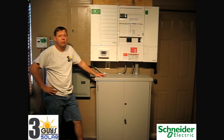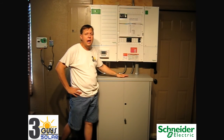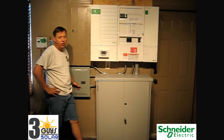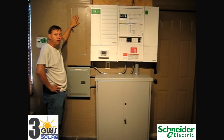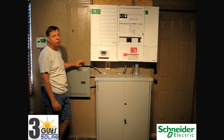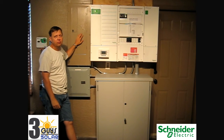As I said previously, this system is grid-tied, so we're going to export excess energy into the grid. The charge controller is going to take the solar from the roof and push it into the batteries. Excess energy from the batteries is going to go through the inverter, converting from 48 volts DC to 240 volt AC. That AC energy will first go into the critical load panel to power all of our loads. Excess energy will go out through our AC1 input to our 60 amp breaker and existing garage panel, powering all loads there. In the event there's more solar available than load needed between the two panels, excess energy will be exported and sent out to the grid and sold to the utility company.